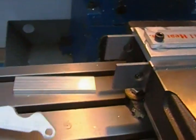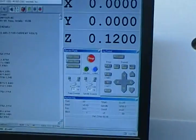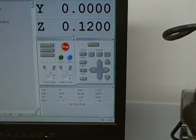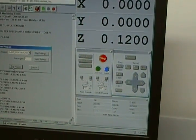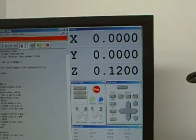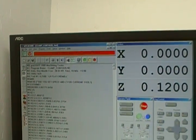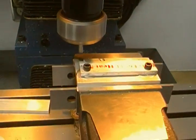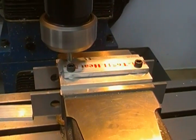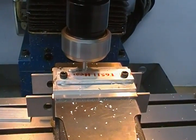After the program runs, we'll end up with a profile that looks like this. So we'll go over to the software and hit cycle start. It asks me if I've set the speed already, and I give a little warning to set the speed and the Z height — which we have been known to bugger up — and then we'll hit cycle start again. The machine will run and our tool will come over and start cutting our little profile. I've cut this a few times so the software is relatively optimized.